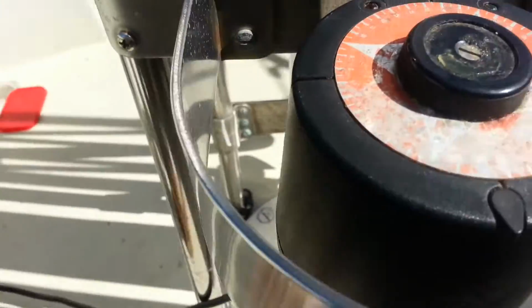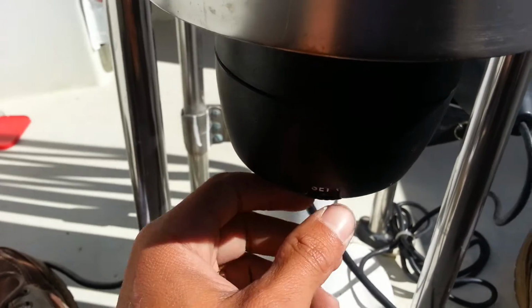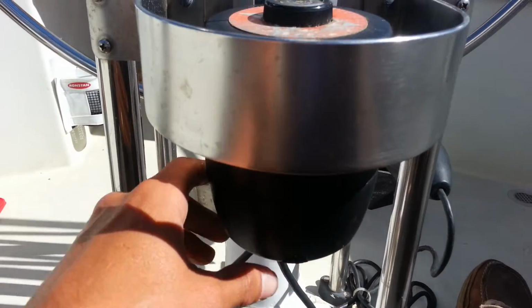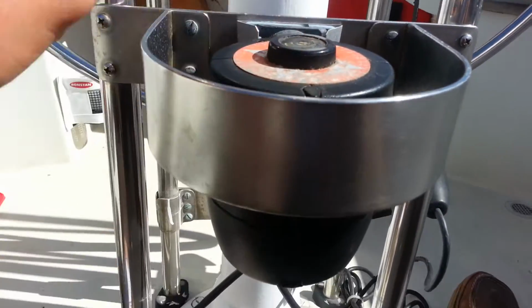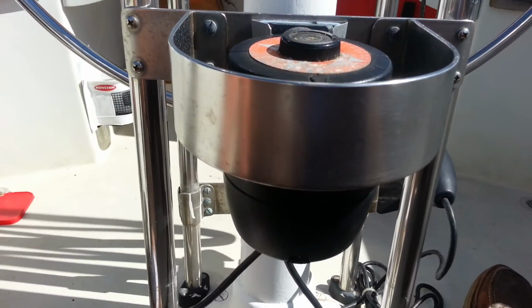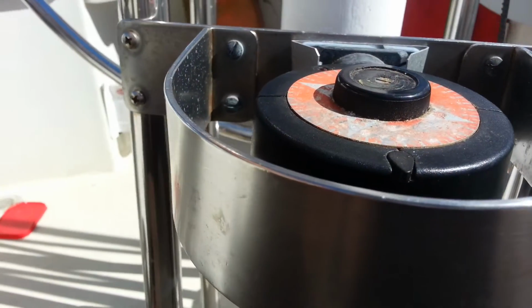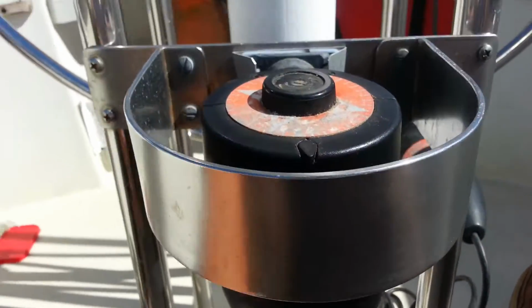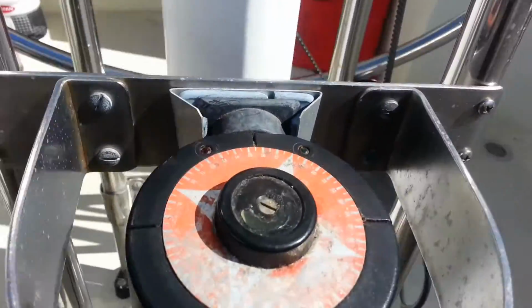And then what you do is come down here, and instead of at set, you want to switch it to one. And now it's going to hold it at that bearing that we just set up here. And if we start to rotate, it will actually engage the steering wheel. Gotta unlock it first. And it will show us which way that it's turning.